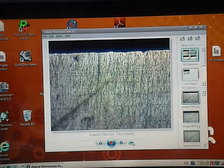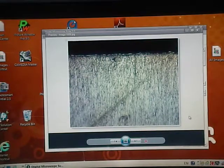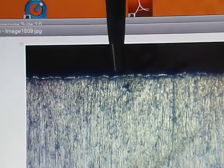And I'm going to pull up the last photo from before just to illustrate that false edge area that I mentioned. And that is at the very edge, and I'll zoom in on this. You can see where there's a darker line and then a sparkly line above that. That is the feather edge that's been folded over from the other side, and it reflects light. The darkness just below it is a shadow. So our goal is to replace that with, and here's where we are currently right now, with a more linear, and this is stronger steel. So now we want to refine this a little bit more by going back to the stone. And then I think we'll be done.